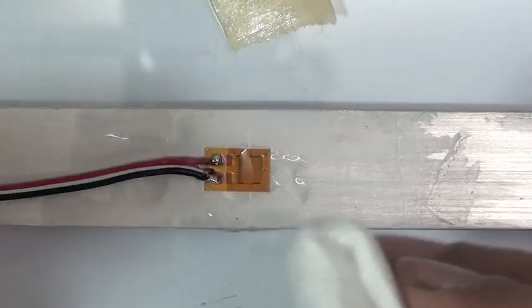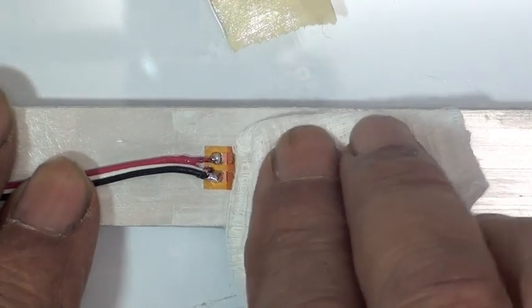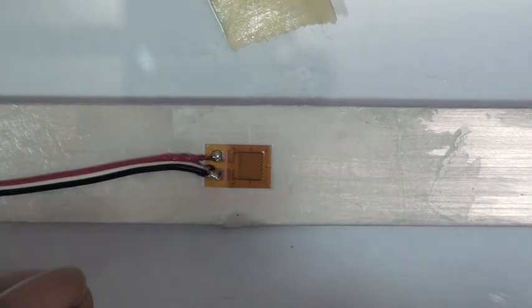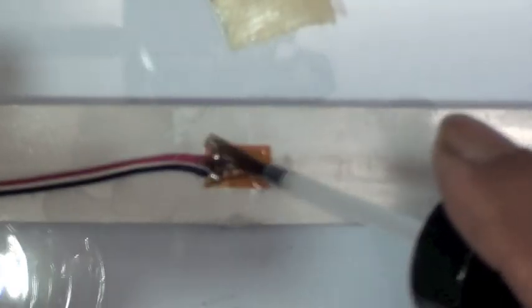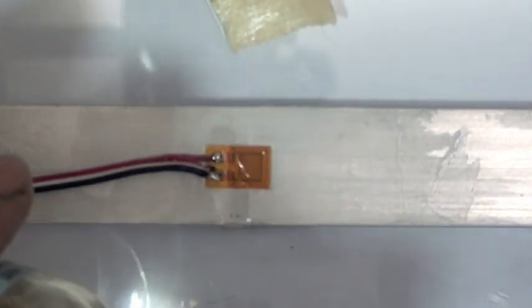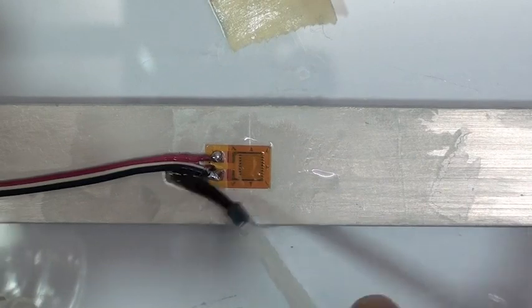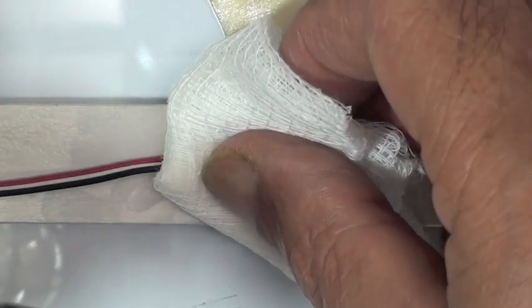So we're going to do this three times, which is what BJ is illustrating here. He's going to blot it dry. Again, the idea is that we don't want to let that liquid dry on the surface and recondense the flux, because then we're just spreading it around. So we want to first put it in solution with the rosin solvent and then absorb it with the gauze sponge to make sure that we've removed it. And this is so important, we're going to do it three times.